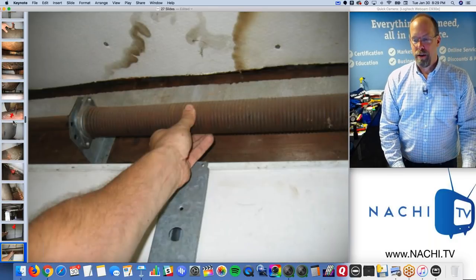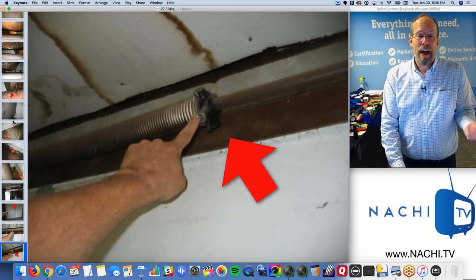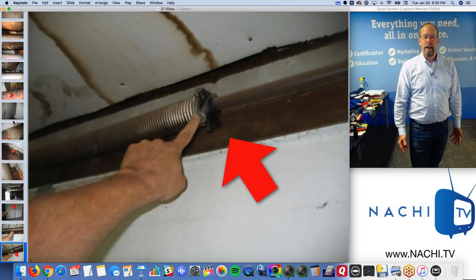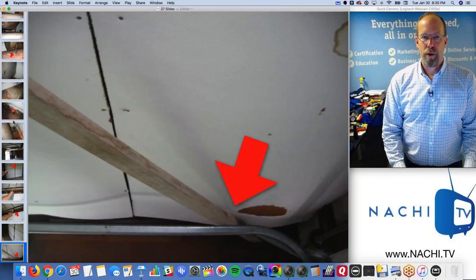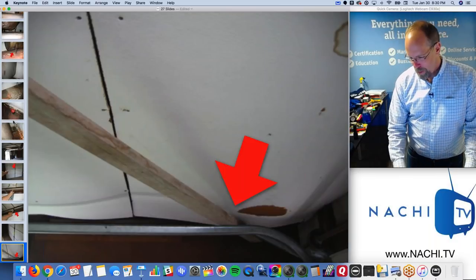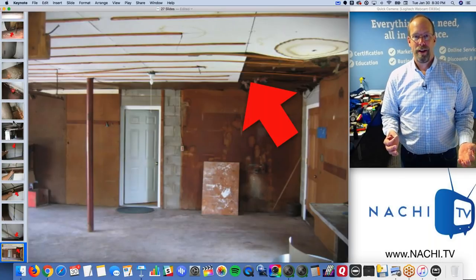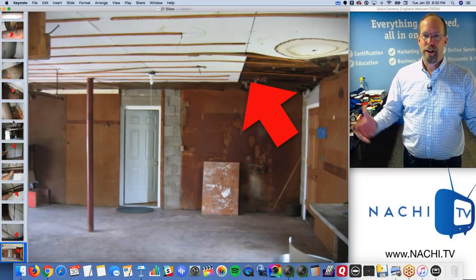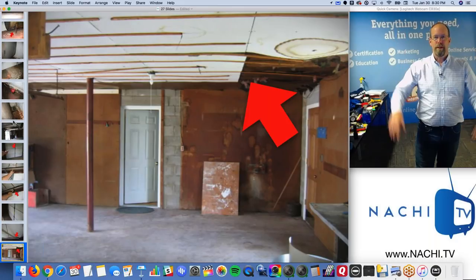This garage door won't open. The spring coil, there's something wrong with it. Defect. Done. I don't have to thoroughly diagnose the problem. The door did not open. I think it's this. Defect. Further evaluation. The other door opened, but there's a 2x4 lying on the rail. That's no good. I think it's holding up the ceiling, which is a fire hazard. Shouldn't have combustible materials like this exposed in a garage. A lot of people work on their cars, battery sparks, boom, right?